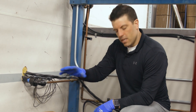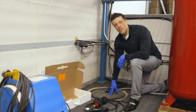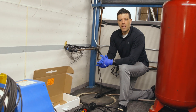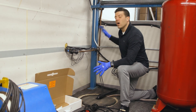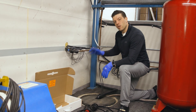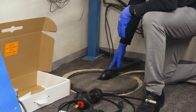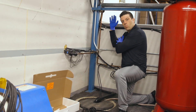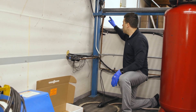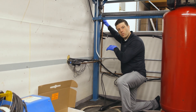We're in the building now, down in the area where the sump pit is located. Like any sump pit in any mechanical or maintenance room, there's a lot going on here. We've got the sump pit, the polyethylene pipe coming up out of the sump pit, going over to the wall, and then headed up the wall to a conveniently located 90-degree elbow. We'll go up top when we're done here to show you that — that is where we're actually going to insert the RetroLine internal heating cable.